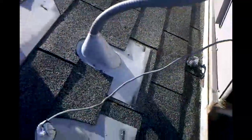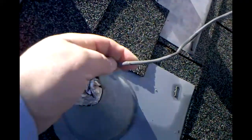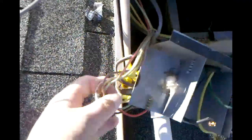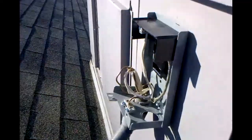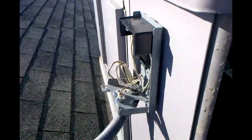The thermostat wire dried out by the sun and shorted out. Installing a disconnect, straightening that out, killing the power by the breaker, and putting an external disconnect on here and running some seal tight to get that taken care of.